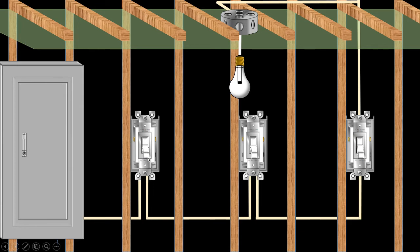So let's see what's happening here. It still operates the same as our three-way switch. I can move those switches into their alternate positions — we're not going to call it on and off again because there really isn't an on and off position, there's just up and down basically. With those switches we can still operate them like a three-way switch at either end, but the main difference now is that I have this four-way switch in between. If I flick this four-way switch, my light comes on. I can go over here, this one turns the light back off, and I come back over here and turn the light back on.